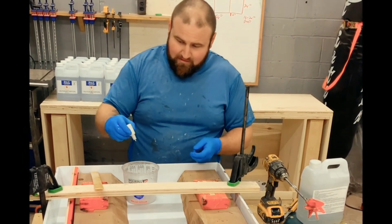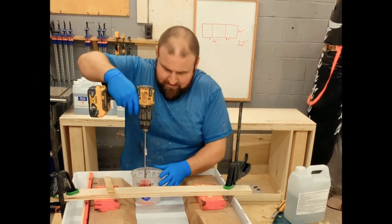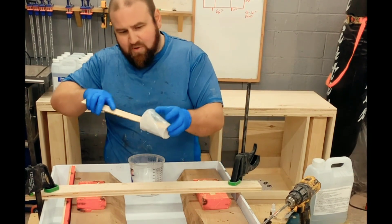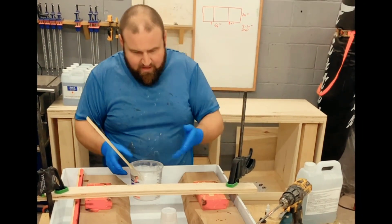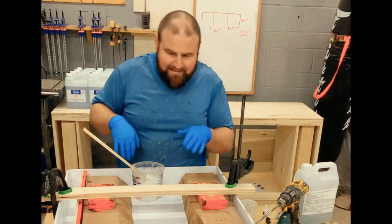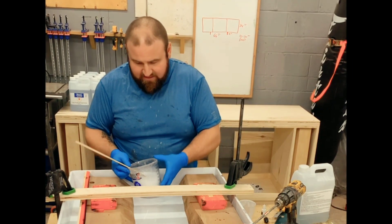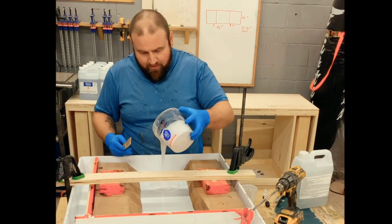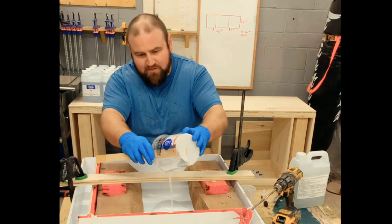This is a new liquid color that I'm trying, so I'm just gonna put a bunch in there and give it a mix and see what it looks like. We've got our piece clamped down and the epoxy should be nicely mixed. We've already cleaned and sprayed out this mold. Because the sides will be visible, I want to make sure I don't get any of this up on the edges. We're just going to pour this amount and let it set up. If I feel like I need to make it a bit thicker, we'll do a second pour — I did end up adding a second layer to this.